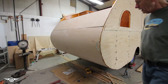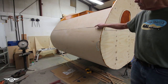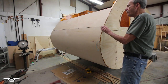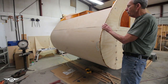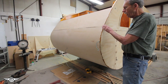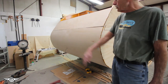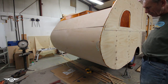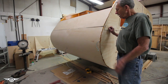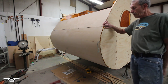These came out perfect. But at any rate, it's on there. It's stapled all the way around with three-quarter inch staples. I had to start at the top with screws because the staples — because this paneling is so thin, it's about half the thickness they used to make it, and the middle ply is just cardboard filler. I hate this stuff but it's getting harder and harder to find good paneling. So I put screws along the top to hold it because this radius kept wanting to pull the thing out through the staples. We got it on there now — it'll start molding to its own shape. Later on we'll cover these screws up because they're flat screws, and there's another layer that goes over all this.